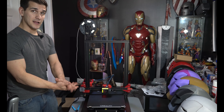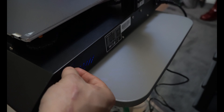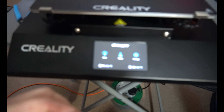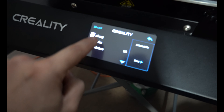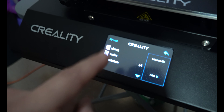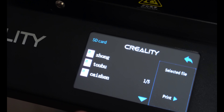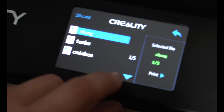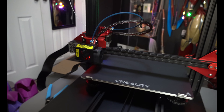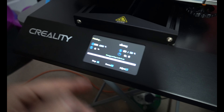We're going to throw the SD card in and send our first print. Put your SD card in upside down — like almost every CR series printer. For anybody having issues with SD cards reading with the touch screens: if you loaded G-code and can't see your print, the file name is too long. There's a character limit — go ahead and rename the file to a number or letter. We're going to go with Zong and hit print. It's already preheated, so it's going to go through that leveling system again because we selected auto leveling — it'll do this before every print. I had the temperature too hot; I was preheating for PLA Plus, my bad.